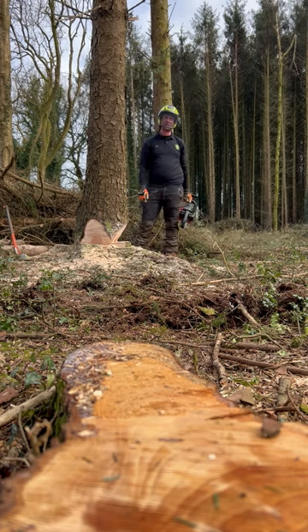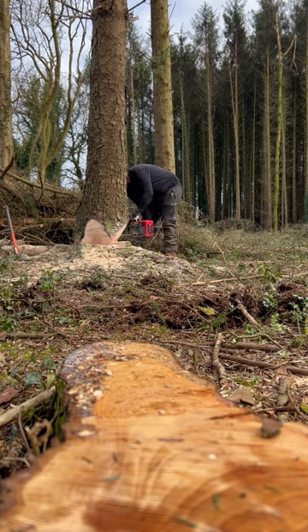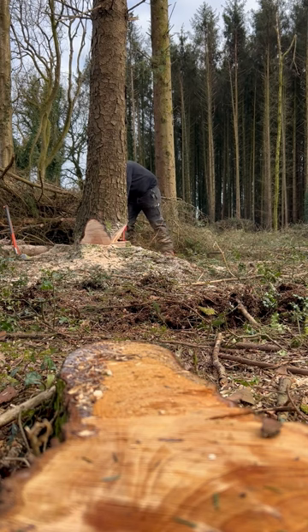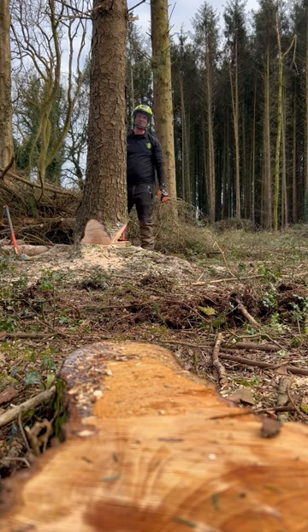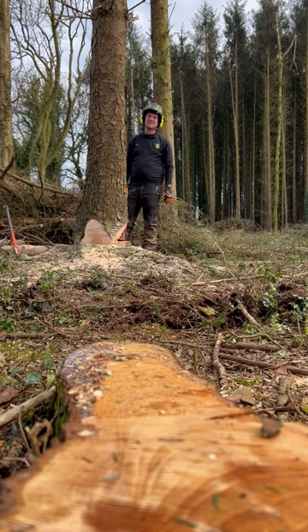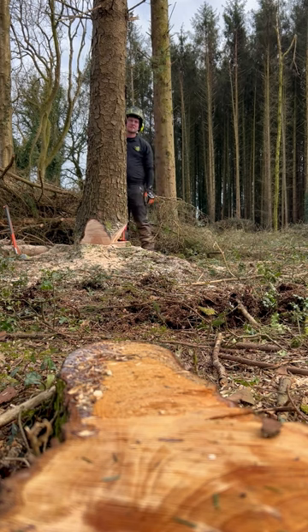That's rotten in the middle - that's what we're going to do. Don't go too close on the sides; do exactly what you're doing. Boring, come back, we'll wedge him in there, and rub that wedge in the butt. Hopefully the timber on the back's good - we'll find out when we cut through it.